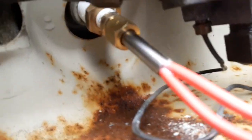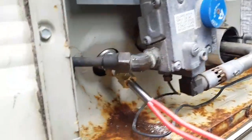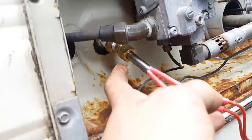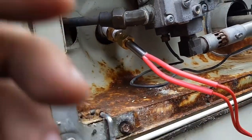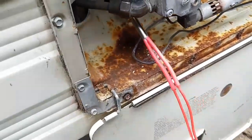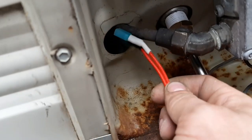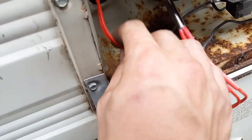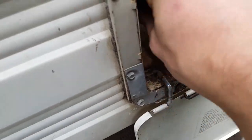The tank's filled. It did have a very small leak underneath - I just had to tighten not the compression fitting but the middle fitting a couple more turns. Now what we need to do is tuck our wiring in through the chassis or casing, in behind the water heater, and get in there and start the rest of our install.